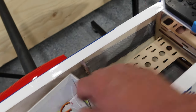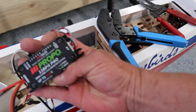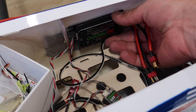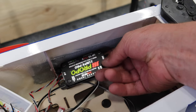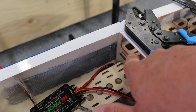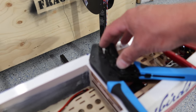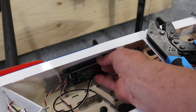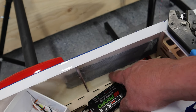My plan is to put the receiver right in this area here. We're using the JR 11BPX Pro, and it's going to be sitting upside down just like that. The reason I'm mounting it that way is all of our plugs can come into the outputs right there underneath the tray, so it's going to be nice and clean. Our battery leads are going forward right to the batteries, which are going to sit in this area and be removable so we can take them out for charging. That's why we're going to put the BPX Pro right there - it's going to be a perfect spot.